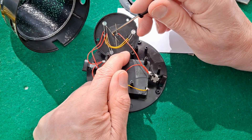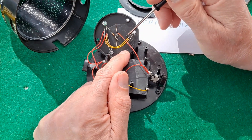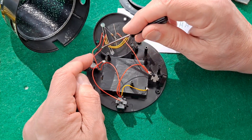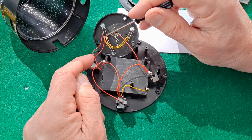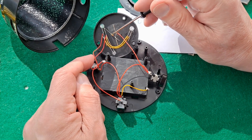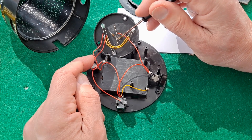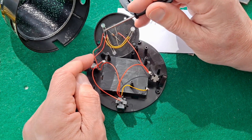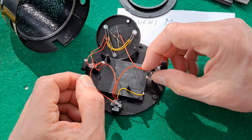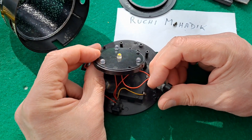For the LED in the middle — there's only one LED there — they've got a resistor in there to drop the voltage a bit. The negative wire there goes to that leg, and then they're connecting from there via that resistor to the other leg of that LED. So that's two separate circuits on top of each other.